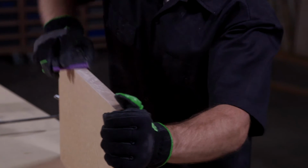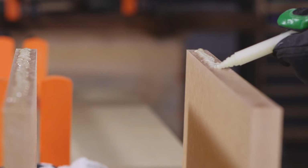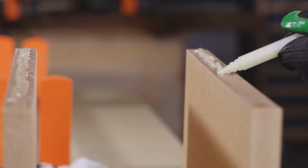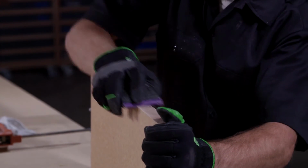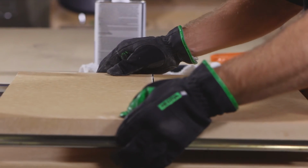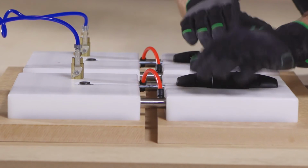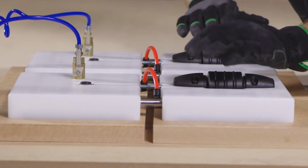Epoxy only seaming is appropriate as a non-structural solution when two Richlite surfaces are fully supported on both sides. Make sure that the joint gluing surfaces are roughed up 100 grit or less for better glue adhesion. Do not over-tighten clamps to keep enough glue in the seam. Vacuum clamp fixtures work well for surface alignment.